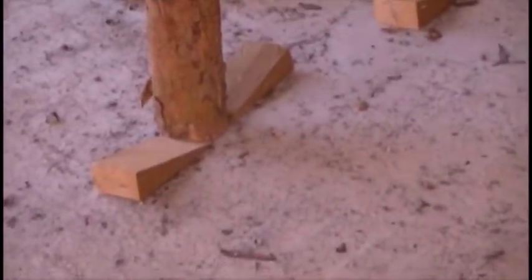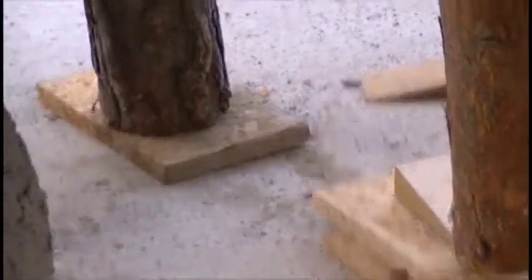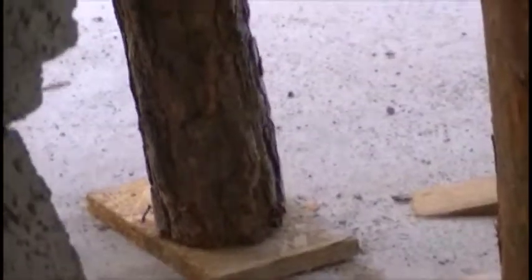The whole structure must be firmly wedged. Wedges after setting must be attached to each other or to the post so they don't have any opportunity to expand. Remember that the design should be done with a camber, so it's necessary to create a gentle curve facing upwards, ideally a difference of about 3 centimeters.